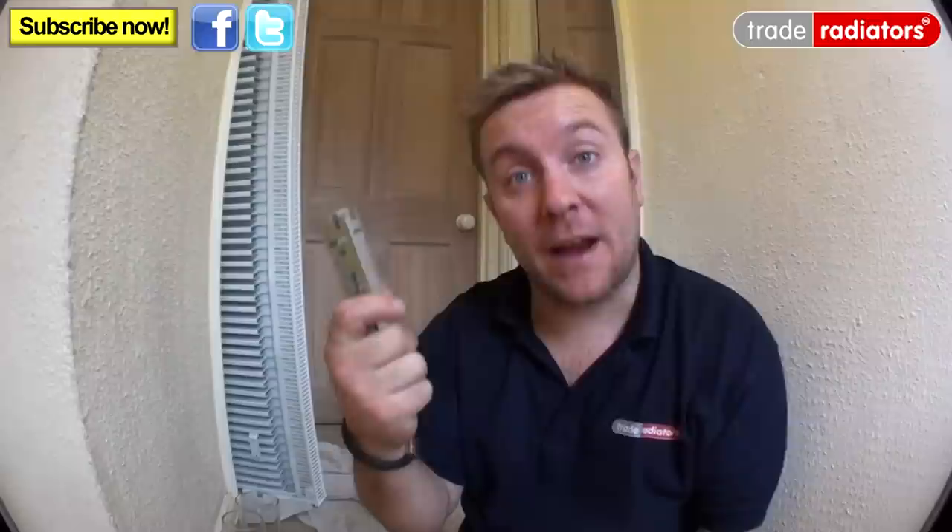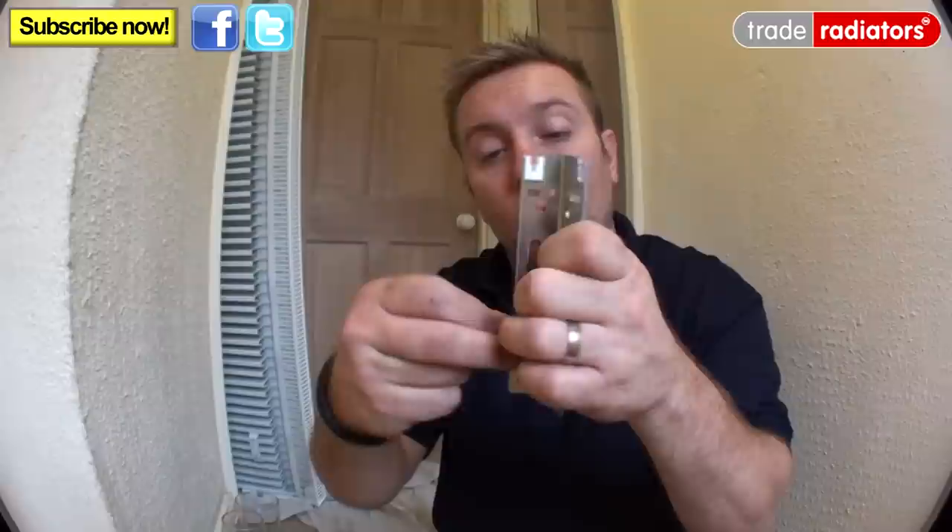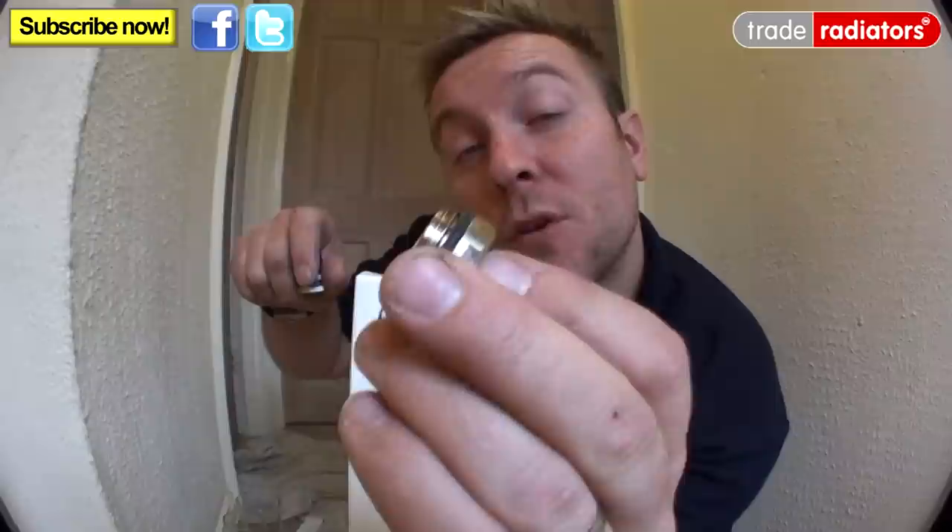Before you fully unpack the radiator, make sure that you check for damage. Also, make sure that you find the two brackets — or three brackets if it's a big radiator — and pop them to one side, and also the small box that contains the grommets and the inserts for the radiator. You'll notice that on the box it says Quinn Radiators because they are the manufacturer of this particular radiator. Undo the box at the end. We're going to have our radiator standing off the wall the smallest distance, so we're going to pop our grommets on. All they do is prevent the radiator from clicking when it heats up and making noise as it rubs on these metal brackets.